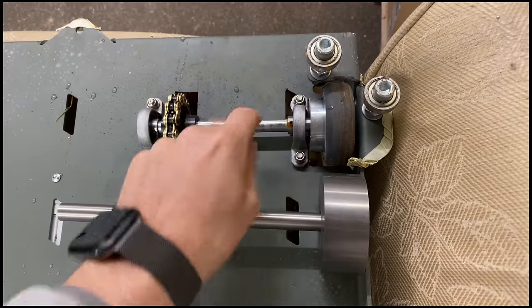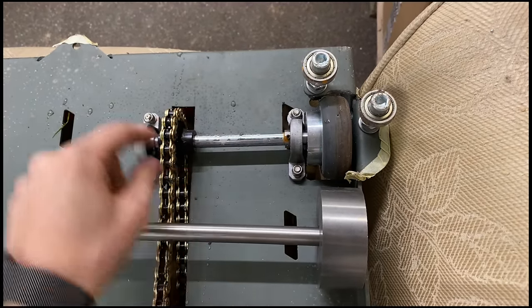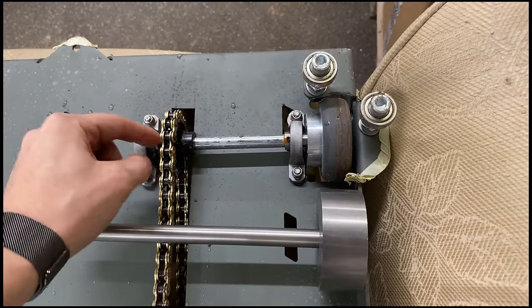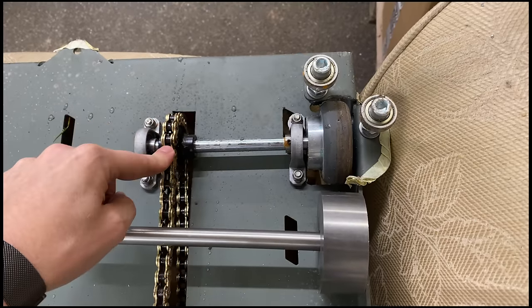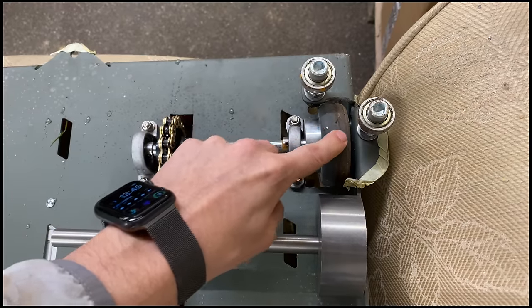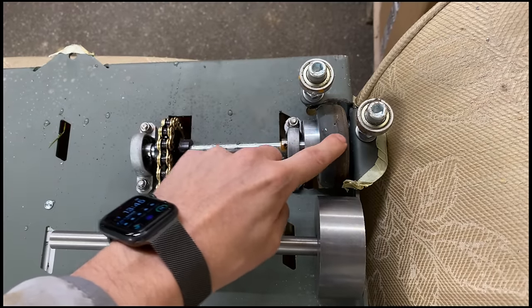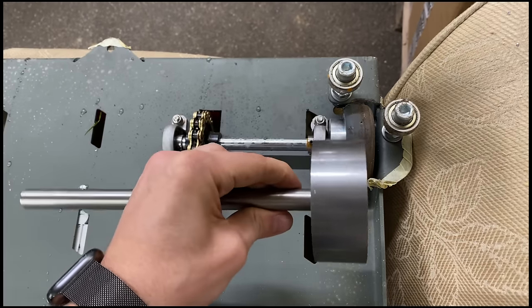So I need to make some improvements. First, this shaft is too small — I'm using a 15mm one now, so I need new bearing blocks. While I'm at it I'm also switching to a belt drive because the chain is too noisy. This wheel gives nice traction but I can already feel a groove wearing into it, so I'm replacing it with a piece of solid steel.